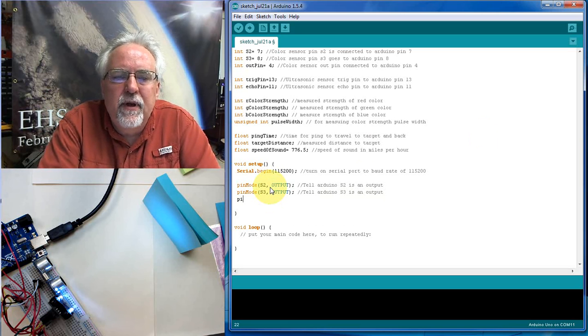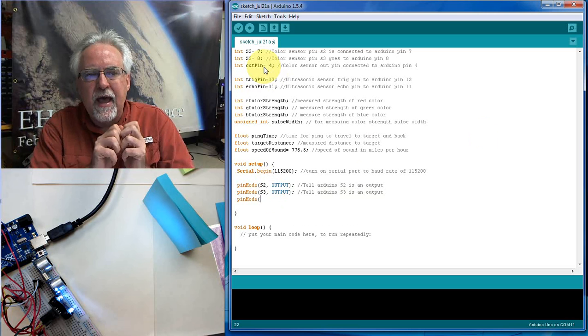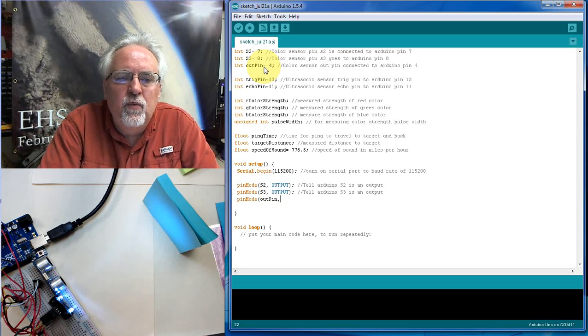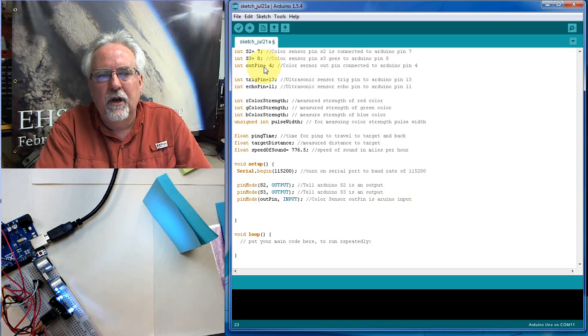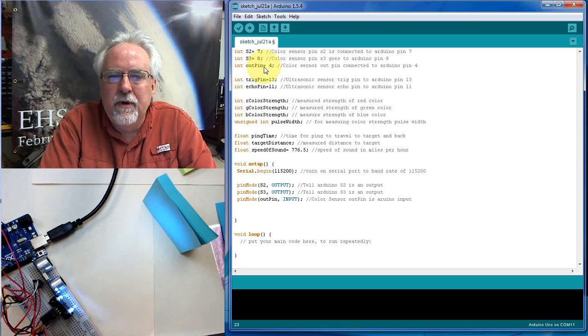Okay, now we also have our out pin. We're going to read to that. The sensor is outputting data to the out pin, and so the Arduino is reading from that. And since the Arduino is reading from that, our out pin will be a what? It'll be an input as far as the Arduino is concerned. Okay, so since the color sensor out pin is Arduino input, if that makes sense. So if the color sensor is outputting something to Arduino, that's an input. All right, so we've got our pin mode set up there for that sensor.